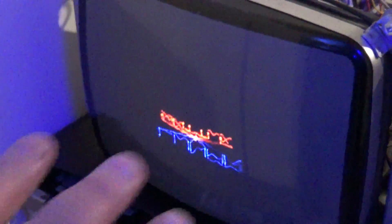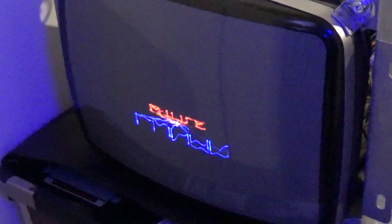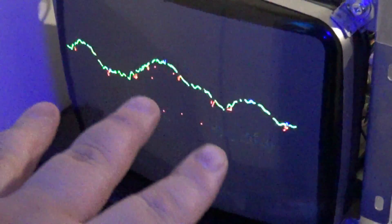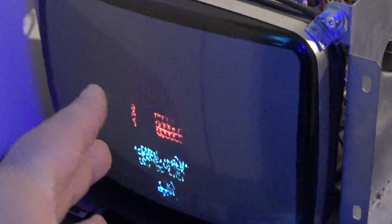I have some issues right now and I know exactly what it is. This is ending up becoming a very complicated yoke winding setup. I have it dead on perfect, dead nuts perfect, but some of my windings are the opposite direction. So I'm going to have to rewind this yoke by putting the windings in the correct direction and have a relay system that's going to change the windings on the yoke.